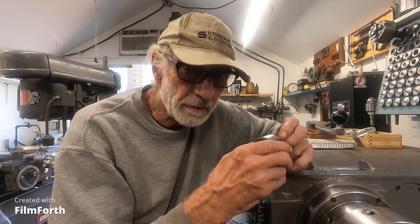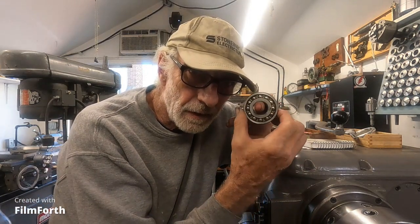And if you're doing long shafts, you'll see me extending things out of the chucks. I get the chucks running as true as possible, and I'll extend the work out and center drill it, right out where it's going to be held. That way I get all the stress out of the piece of metal, because I'm always making something that potentially goes into that.